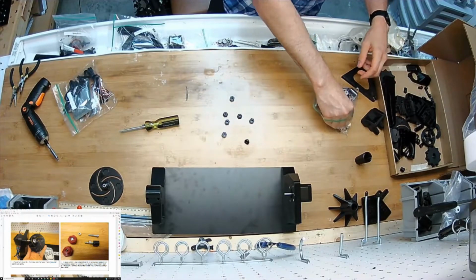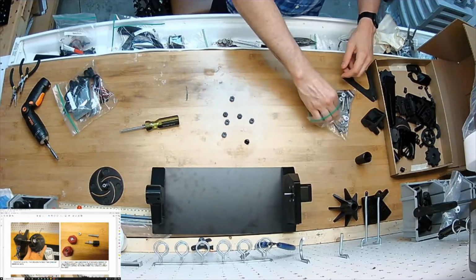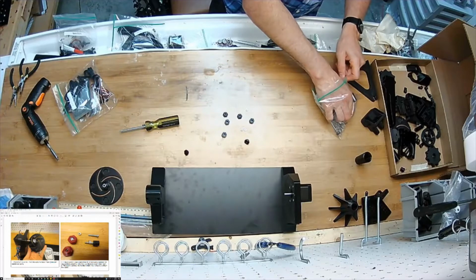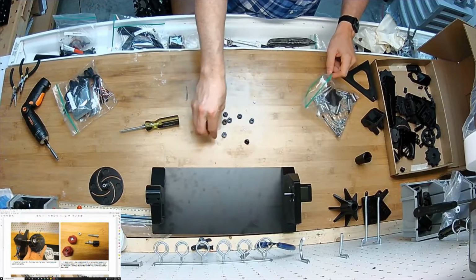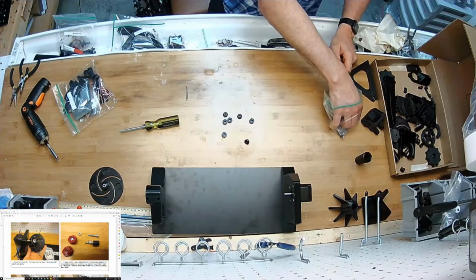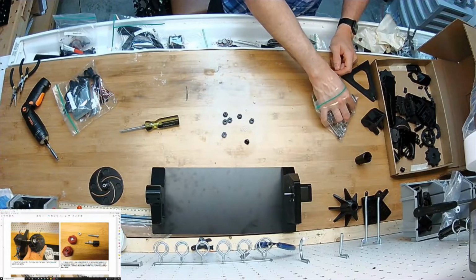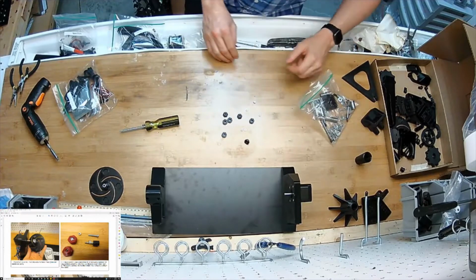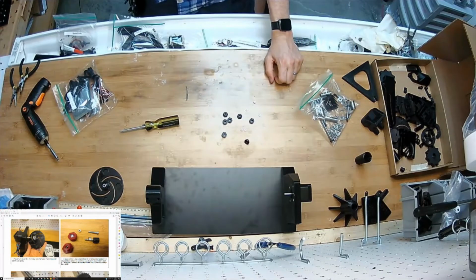And then grab the 3mm nuts. They each get 1 in there because I don't like threading machine screws into plastic on a joint that's going to be repeatedly inserted because they wear out. Right? Machine screw threads are too fine. Anyway, I'll dig the rest of those out off camera.